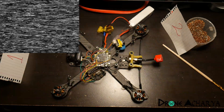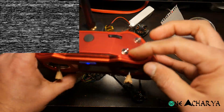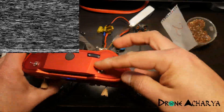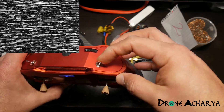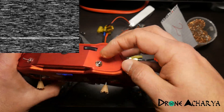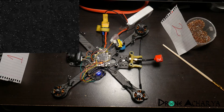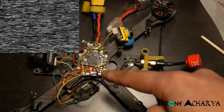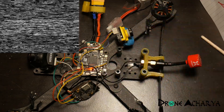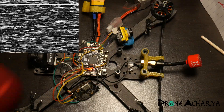I am recording my DVR right now and I'm going to plug in the battery with my switches in the default position — VTX turned off. After plugging in, I'll switch between cameras. So after the battery is plugged in, the flight controller turns on. The DVR showed image for a second, which means the VTX turned on briefly — that's not a good thing.